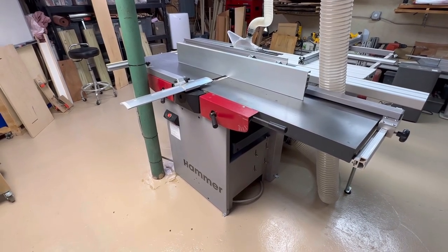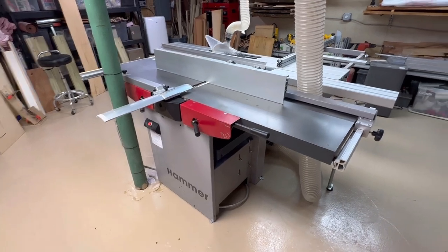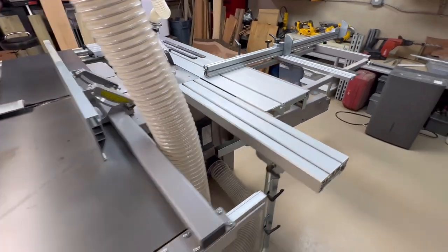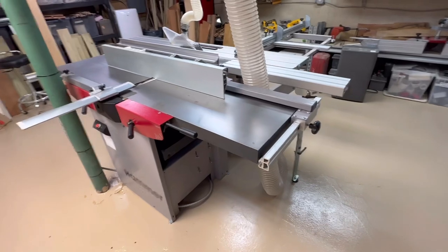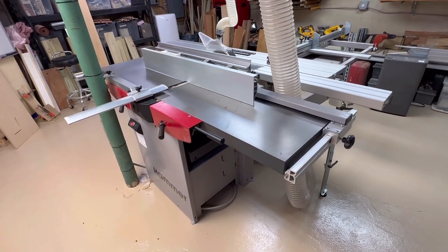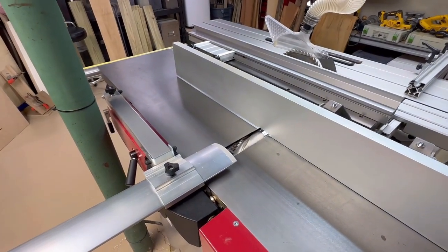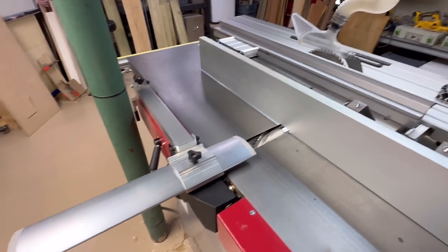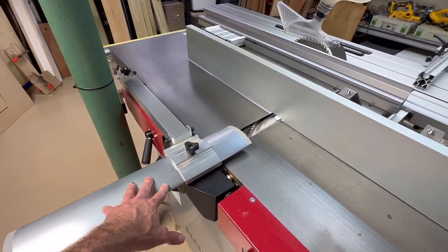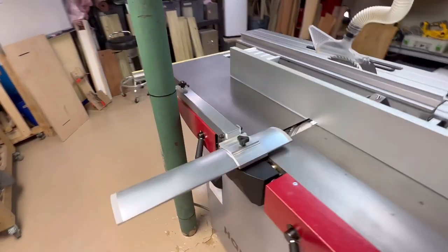I've gotten virtually no snipe on anything I've put through the planer unless I really mishandled the piece coming out of the outfeed. On the jointer, a couple minor things: I do have an extension table that I bought with the machine and have used as an infeed extension for longer pieces — works well. The jointer tables are nice and long, no issues there. The helical head cuts great — 15 months in, I haven't changed or rotated any blades. The blade guard is a minor complaint; I'm used to the American style that swings out of the way, but it's a relatively minor point.